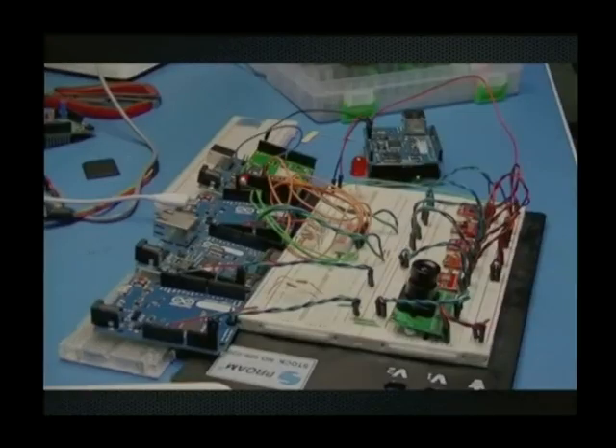At the point I got involved, they had an architecture diagram and a bench test consisting of a bunch of off-the-shelf breakout boards for different sensors. You can see off-the-shelf Arduinos — some Unos, Leonardos, an Arduino Ethernet, and some other bits and pieces. This particular experiment was testing a shared I2C bus where all of those boards are on the same bus talking to the same sensors. They had the basic proof of concept, but it really needed to go a lot further to get to flight-ready status.